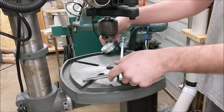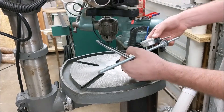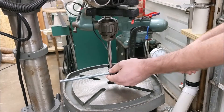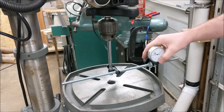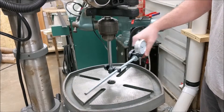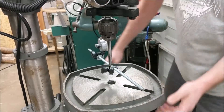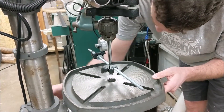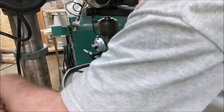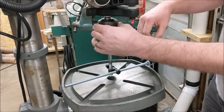The final method is to use a dial indicator in a similar manner as previously demonstrated. I'm using some threaded rod, a dial indicator, and a steel bar, chucked so the bar is free-floating on the chuck. We need to move the table up so it's within the range of the dial indicator, lock it down, and then take measurements at each of the four points.